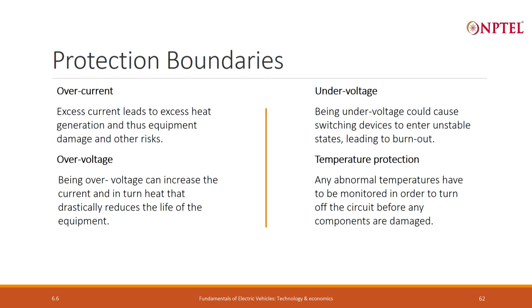We will also have a few temperature sensors to monitor temperature in the battery, inside the motor, and inside the controller. If temperature is rising we have to take corrective action. However, temperature protection is not very helpful for over-current failure conditions, because when there is an over-current, the overall temperature at the location of the temperature sensor will not increase. But because high current is flowing through some track and going to some component, there will be a sharp localized rise in temperature which will not be detected by the temperature sensor. So having a temperature sensor does not mean you do not need over-current protection. All failures are finally thermal, but only certain thermal failures can be detected by the temperature sensor; for others we use current or voltage as proxies to identify failure modes.